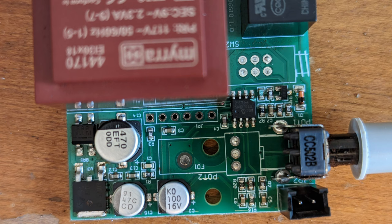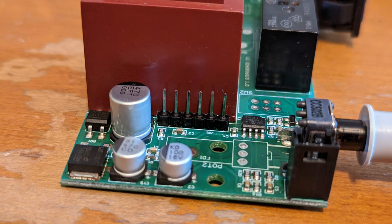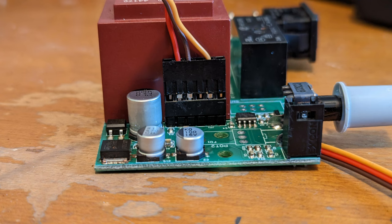So as I was poking around in there, I was like, okay, I gotta probe all these pins, and then staring right at me was a jumper header. As it turns out, I don't have to do anything. It's already there. Eureka has already provided connections to do pretty much this very thing. Red is the 5 volt, white is the ground, and yellow is where the signal goes in to control the relay. So at that point, I soldered in another pin header, made up another jumper, and I had everything wired up and ready to test.